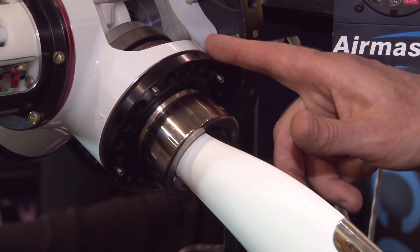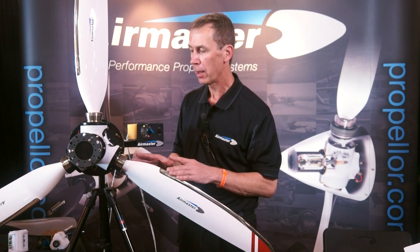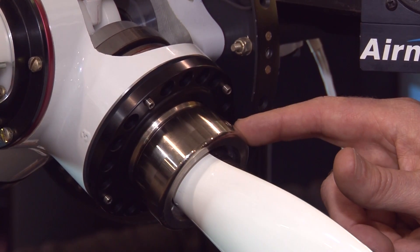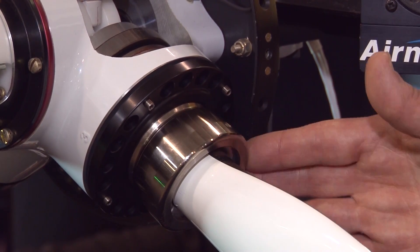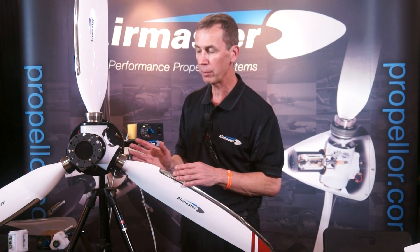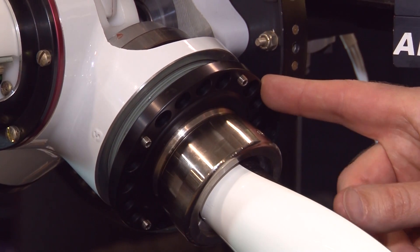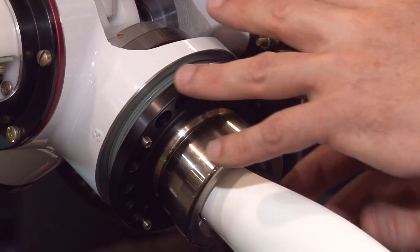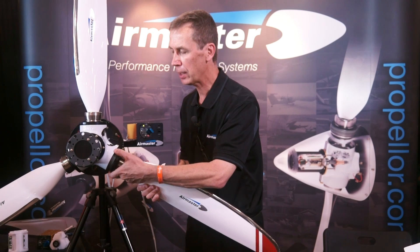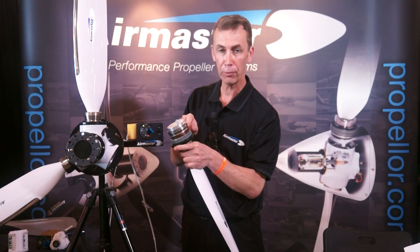This is the retention mechanism. Its purpose is to hold each blade securely and at exactly the right pitch angle for all three blades. It does that by having a high strength steel ferrule and nut that works just like a machine tool collet — it grabs the blade, clamps it securely, and holds it so that all the power transfer from the engine can go through the hub and out into the blade. This is the blade retention nut, used to hold in the blade retention assembly. The whole assembly can be removed from the hub very easily by removing just this one nut, making inspections and regreasing of the bearings straightforward.